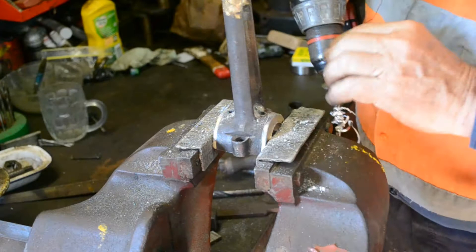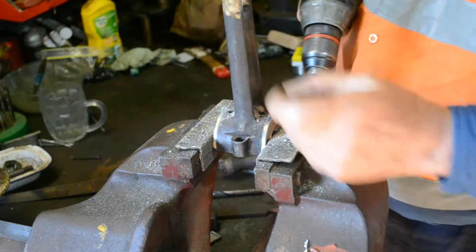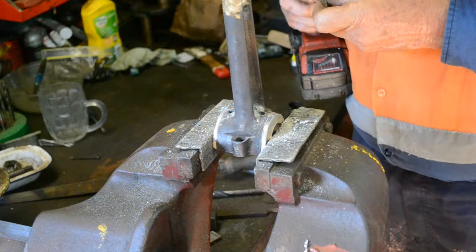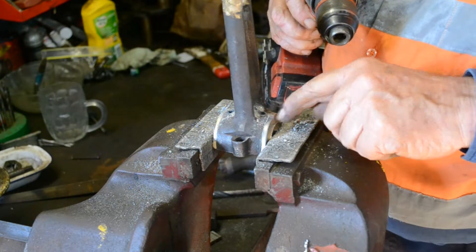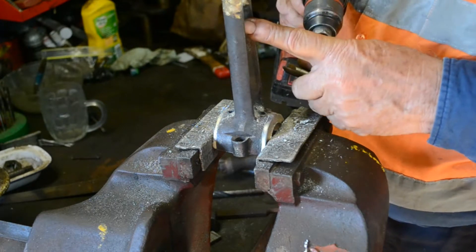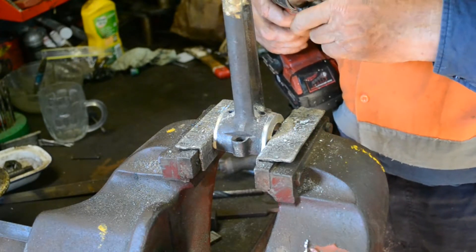With the connecting rod I like to give it a little bit of a chamfer at the top. Oil comes down the webs here and as this is going up and down, if there's a little well there it has a tendency to stay. Not that it does much to the lubrication because this part of the bearing is the pressure side — it tends to push the oil out — but it's good for starting. When it finishes at the end of the run the oil will run down there and flow into the bearing, lubricating it ready for the next time it's fired.